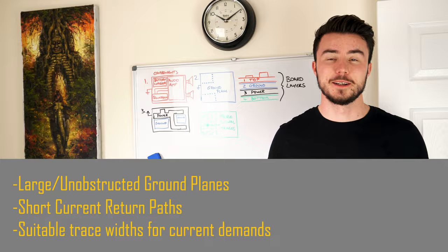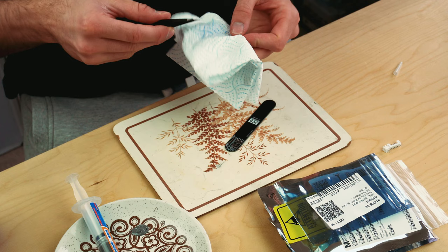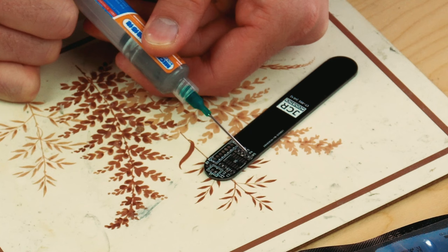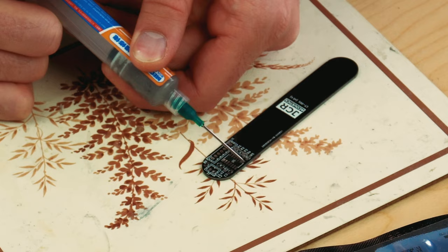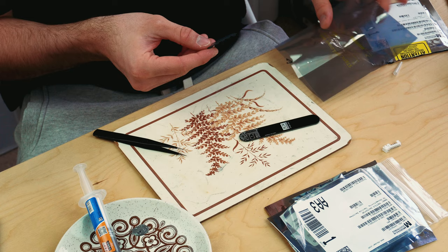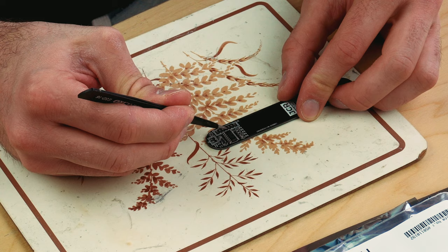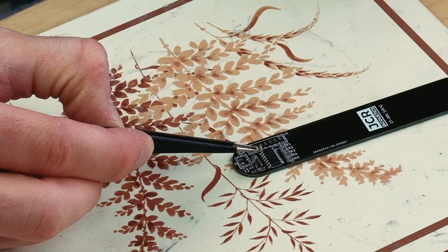Here's a basic intro on how to do SMD assembly in your own home. I start by using methylated spirit or isopropyl alcohol to clean off my board and tweezers, making sure everything's clean and ready to go. I use this solder paste — it's lead-free, a bit old, but it still works fine. Normally if you've got a larger board you'd use a stencil, which makes it easy to fill every pad with solder, but because this is such a small board I'm doing it manually with a needle — it's a bit messy and I use a bit too much, but it gets the job done. It's a slow process, and if you have a big board like the amplifier itself it does take a long time, but I find it quite satisfying.